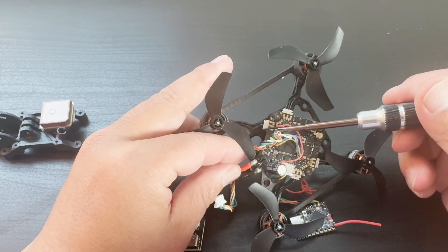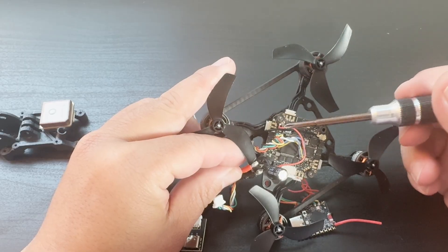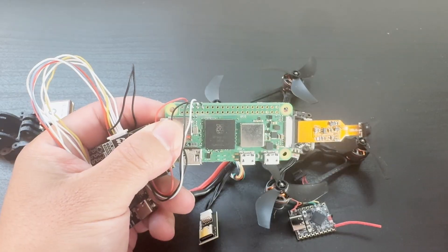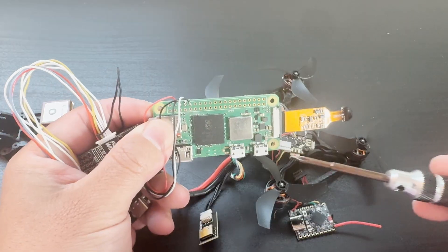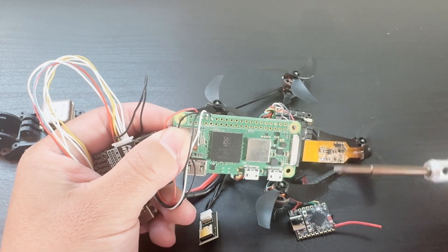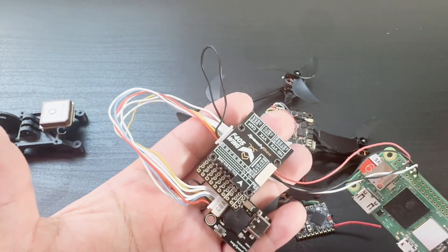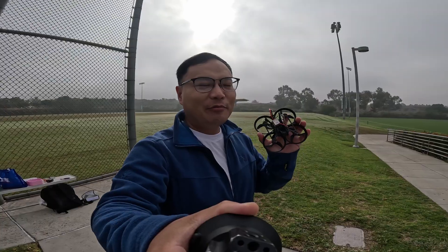We use four UARTs in total: one for the receiver, one as I2C for the compass, one for GPS, and one for the drone bridge. I actually wanted to add a Raspberry Pi flight computer to the flight controller, but unfortunately there are no spare UARTs. I would need to replace one of them. I have been successfully running a neural network on that setup and testing it connected to another flight controller.